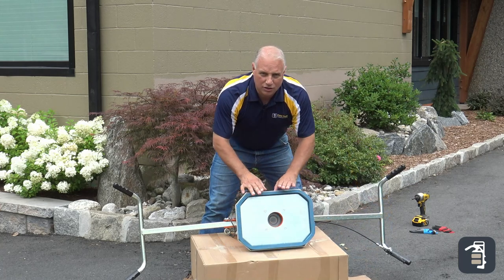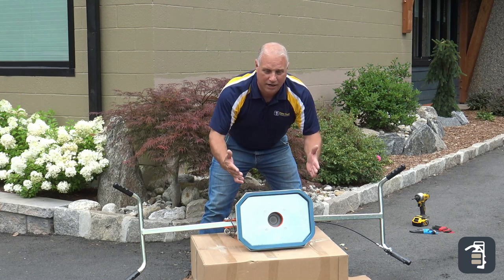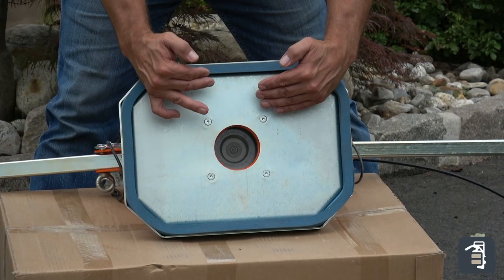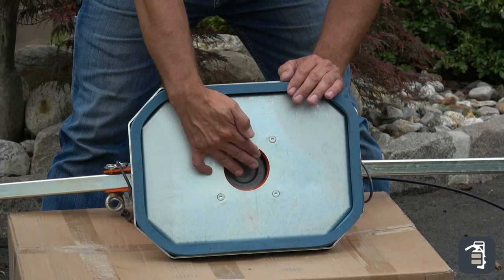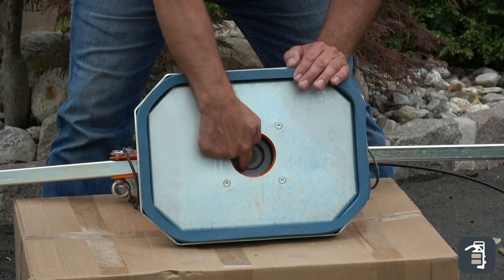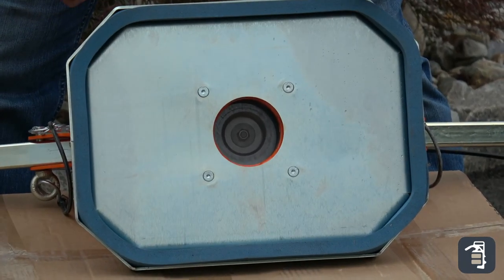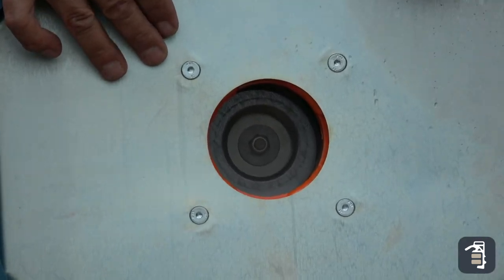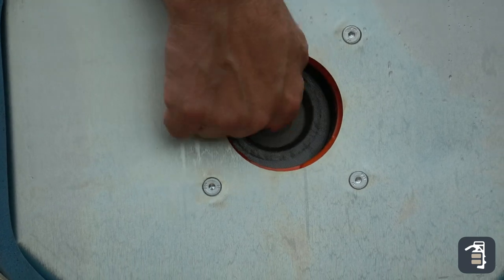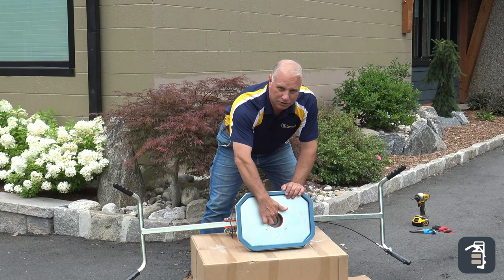When you're operating the 200E, never set it down on your bedding layer or where there's a lot of debris. This is a high-flow vacuum that's pulling a tremendous amount of airflow, and you don't want to plug up or damage the screen. There is a screen that can get plugged — if you are having issues with not being able to suction down to a product, this would be the first area to look. Make sure that screen is always clean. You can use a little scraper, a vacuum, or a little brush.